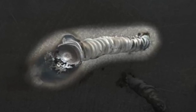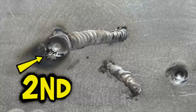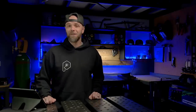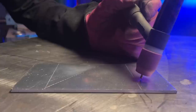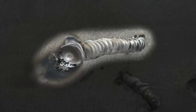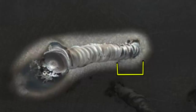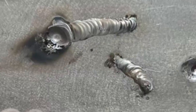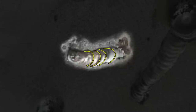Let's take a look at the second pass here. This one totally confirms my suspicions. Mike being a little more warmed up and comfortable for the second pass, we can see he got set up more comfortably to give it another try. What typically happens is somebody gets set up and comfortable for the beginning of the pass, but as they start to advance across the weld, they gradually pull back with their standoff distance. We can see by this photo that Mike was in much closer at the start — we have some proper gas coverage and the puddle is established better. But very quickly, as Mike starts to travel, he runs into an area of discomfort and starts to drift away. The overall finish of these welds looks pretty rough and quite dull, which goes back to the original question about why TIG welds are dull and not shiny. The shape of the puddles is not very round — they look like they've been blown around or mushed.